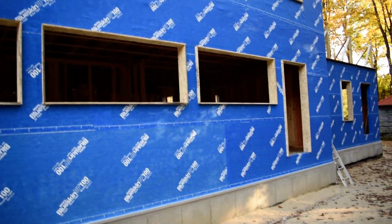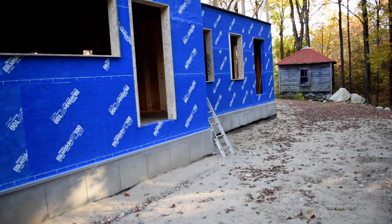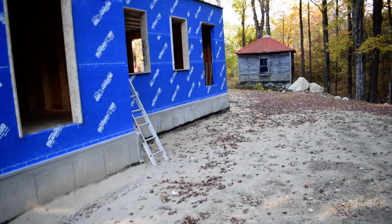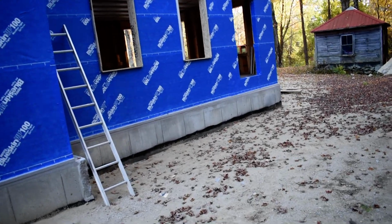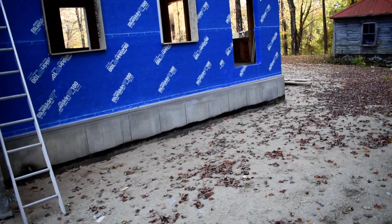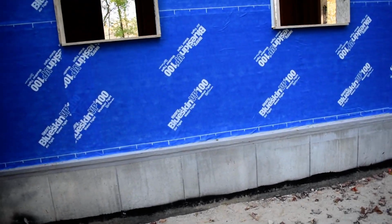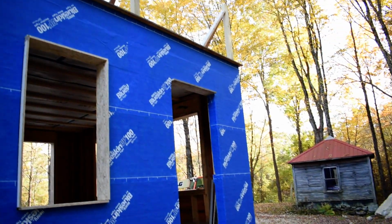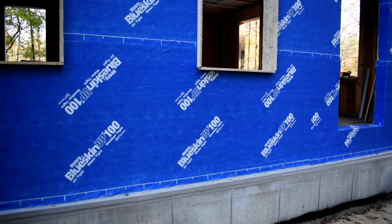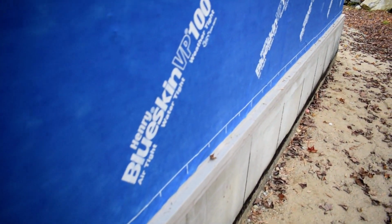which is fine in a normal house, but when you do a really good job air sealing everything else, the spaces that are then not done well leak a lot because all of your air is going through a smaller amount of space. So there was a lot of work and rework done to this wall to smooth it back out. This is where we had so many pieces that just didn't play nice.